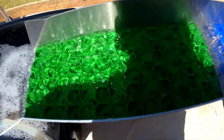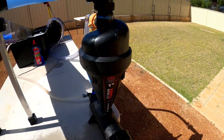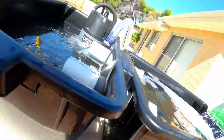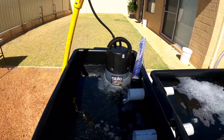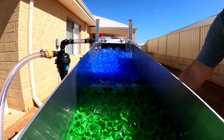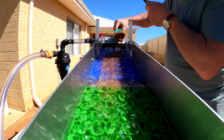I've got the water running nicely with a little bit of jet dry. Apologies for the shade angles here but it is later in the day and it was very hot today so I wasn't too keen on coming outdoors in that heat. There's the little hydrocyclone - the idea is that it's going to return some of the sediment back to the catch tank, and we're going to see how that works in practice. This will be a bit of a torture test because I'll be running the tailings from the super concentrates run from the last video from the prospecting trip. So here we go - this is looking up the sluice and I'll start running some material through.